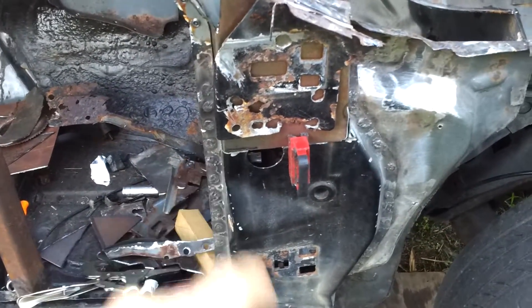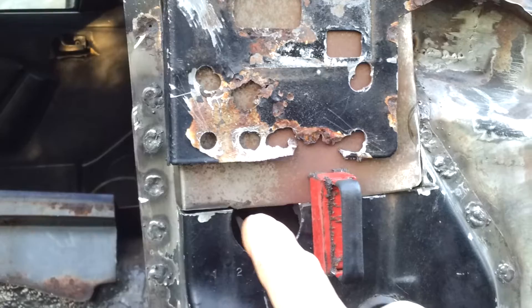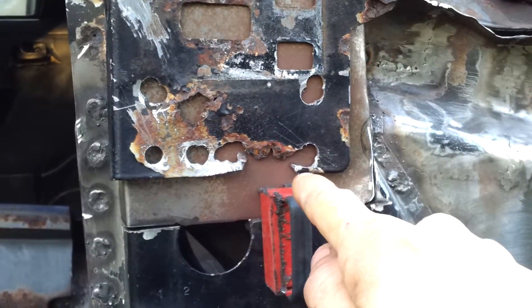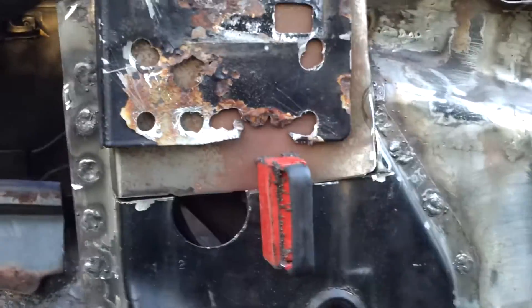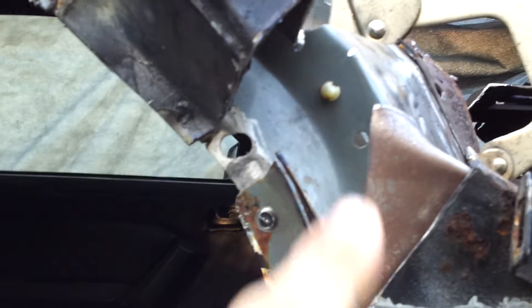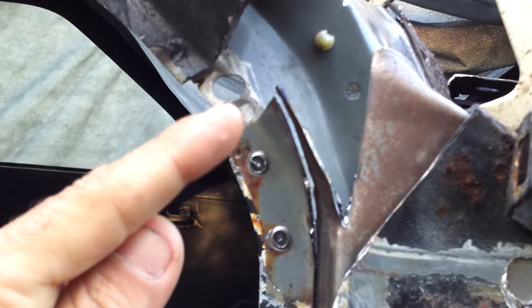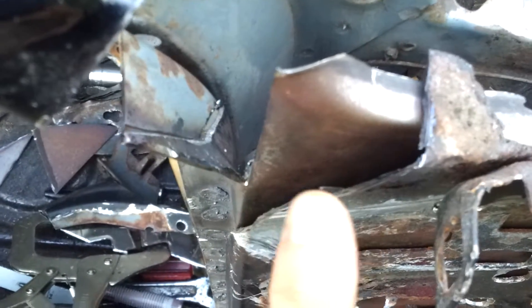Pretty much go in a circle and then fill in the middle. I'm working on the top half for the outer piece — it's pretty much just making it so it's pretty close. The antenna hole is supposed to be right there, but there's going to be a drag car so I'm not going to have the hole there, but you can just re-drill it and do a couple measurements so you know where to put it. I still need to cut that top off. I still got to bend this outward — you can see the gap that's in there. Bending this out and then when I do the outside piece I can keep messing with it until I have them matched together.